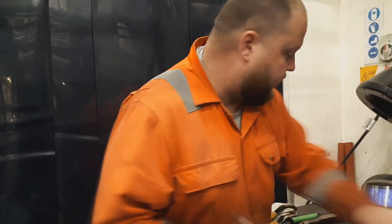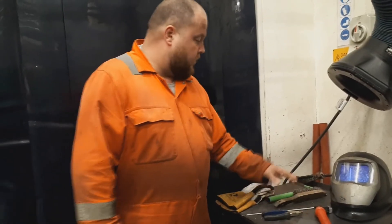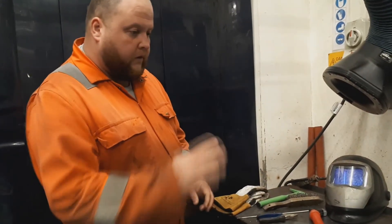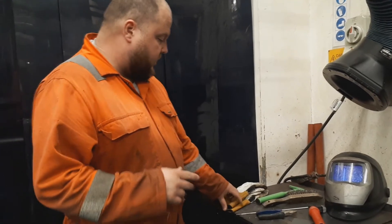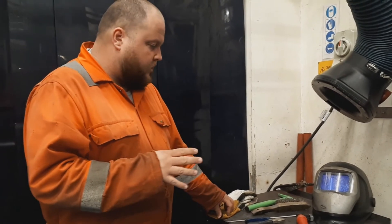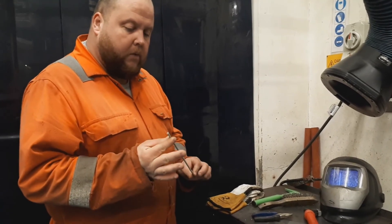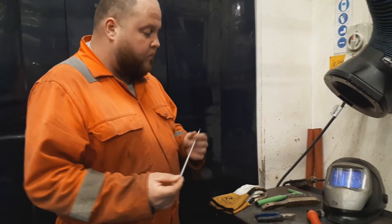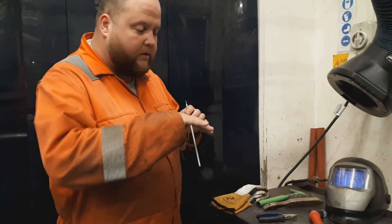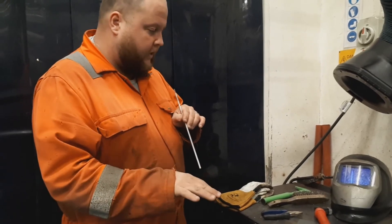Other auxiliary equipment we're going to be using includes pliers for picking up hot material, a wire brush for cleaning down, and a chipping hammer for removing the slag that forms on the outside of the weld. That slag does multiple things — it helps protect the weld while it's cooling down and helps maintain a nice consistent bead profile. The flux covering on the outside produces the slag, creates arc stability, initiates the arc, produces a gaseous shroud around the weld area, and helps direct the molten metal from the electrode.